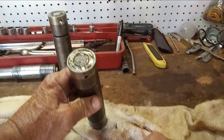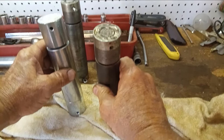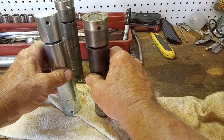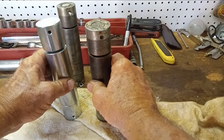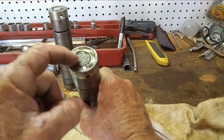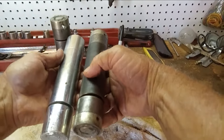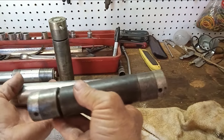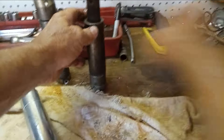Now I can re-weld that. If I re-weld it then it's as good as this brand new one, but do I need to re-weld it? Other than the fact that a cotter key could shear off — so if you're worried about that, get some grade-eight bolts or latch pins and put them on it. Then why is it even worth the effort of welding? What are you accomplishing? Again, I just can't see that the brand new uncracked pin is going to do anything or affect the performance of the machine any more than the two broken pins.